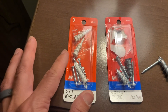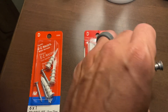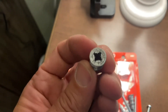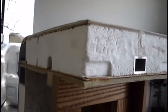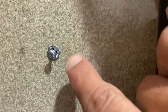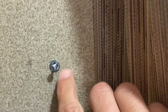Some of my favorite anchors for hanging stuff on an exterior wall are just these easy anchors right here. They have them in plastic and in metal and zinc coated. What you basically do is take the sharp tip and push it right into your wall, then take a screwdriver and screw this into the wall until it's flush. This is great for your exterior walls because they're basically filled with a styrofoam material — this goes in real nice and easy, holds tight, and does not want to back out. I already did one here and it's flush up against the wall. You take the screw that comes with it, screw it in, and it leaves you a nice little place to hang something. I can pull on that and it's real tight — that is not coming out of that wall. Just make sure you check the weight limits for whichever hanger you purchase.